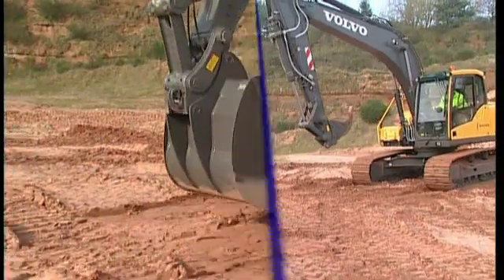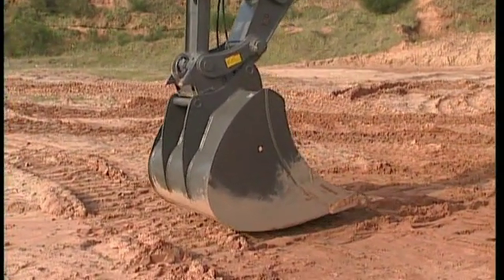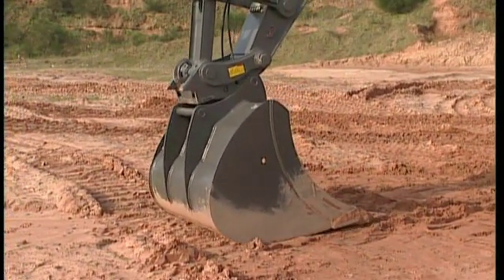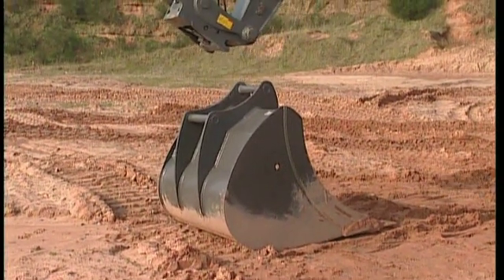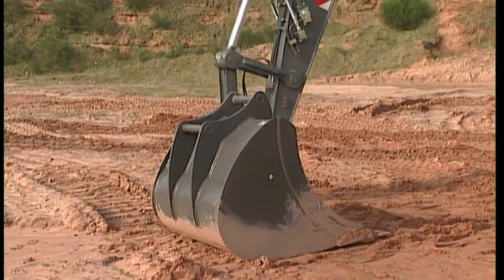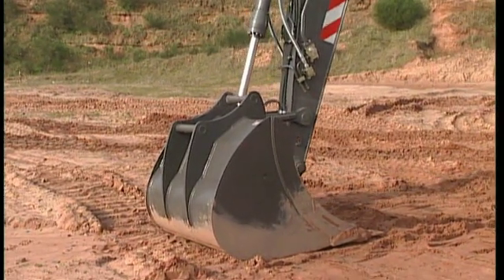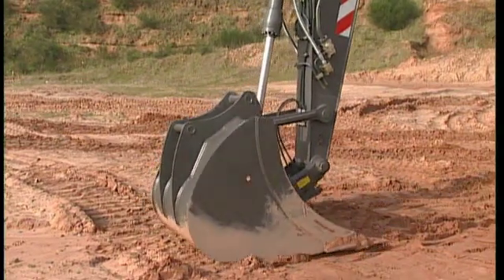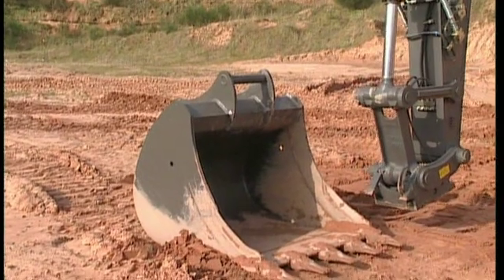Your S6 QuickFit is symmetrical and your digging equipment can be used to turn the bucket. But you can, of course, also reposition the excavator. Sometimes you may destroy the underlying surface, so the final decision is up to you. Operate the digging equipment smoothly and slowly so as to avoid any scratches or damage to the components.